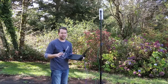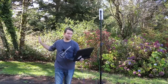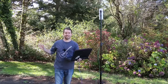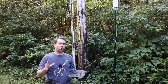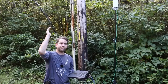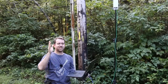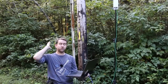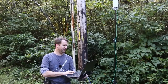I want to do a tougher test. I'm going to leave the access point where it is and move to a different spot about a quarter mile away through houses and forests — basically down my entire street. At that location, with the Nanostation up on a pole and shooting through houses and forests, I'm getting no signal whatsoever. It's not connecting at all. This may be too much distance, and there's also a ton of other wireless interference — I'm literally in a residential neighborhood so everyone's access points are showing up on the list.